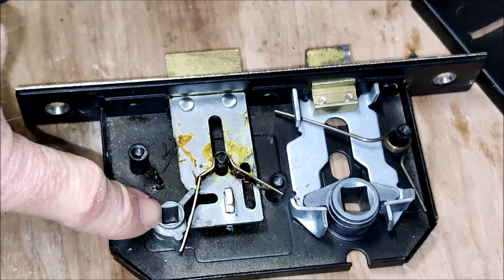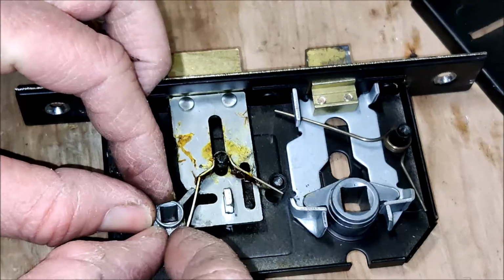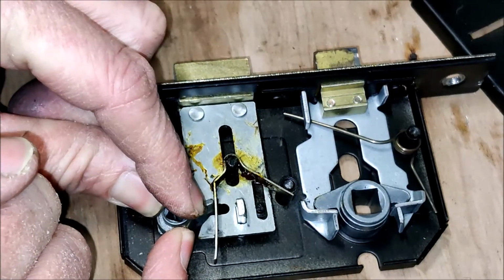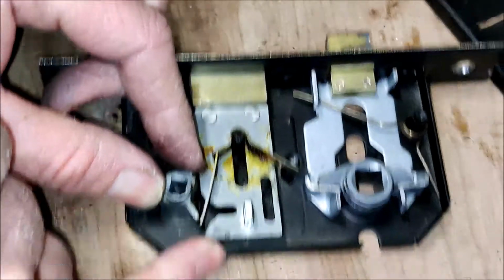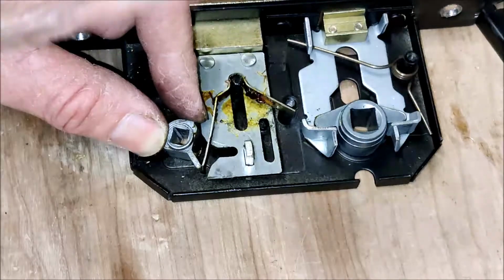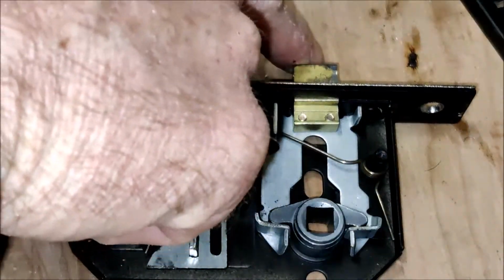So when the small square profile bar is passed through there and turns, the spring gets pressurized back, the deadbolt gets pulled back, and then this key here falls into this natural position with the spring holding it in place, so you get that nice definitive ka-dung. And then we go back the other way, you get a ka-dung. Anyways, the deadbolt wasn't my problem, it was the latch.